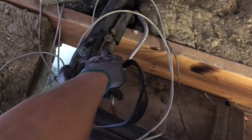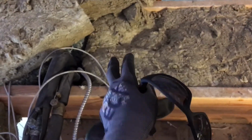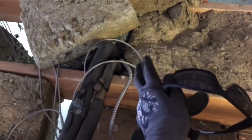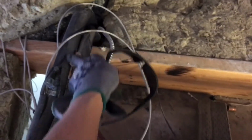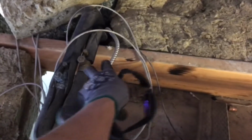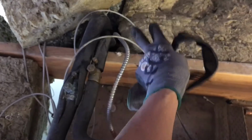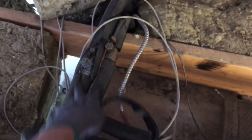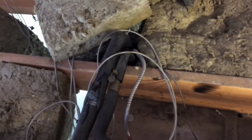And then you have your ball valves, so you can isolate all your different rooms. If you had to service, you developed a leak, or for some reason you want to upgrade or change your head, you just isolate them at the ball valves, and you just recover the refrigerant out of the short piece of line that's about 2 feet long. Perform your service, plug it back in, and you only have to evacuate and nitrogen purge your new unit while the old system is isolated, and then you open up the ball valves and you're off and running. Nothing complicated.